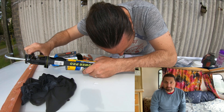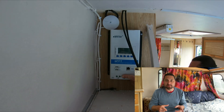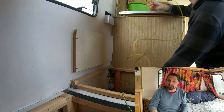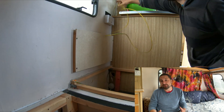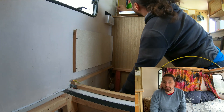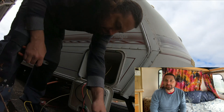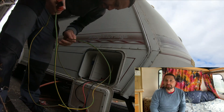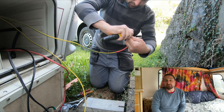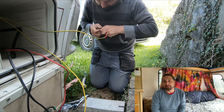After passing the cable down through the roof I fitted the charge controller. It doesn't look straight in this shot but it is — the GoPro camera I film with has a fisheye lens which distorts things. Next I read that I had to power up the charge controller from the battery before attaching the solar panel, so I ran cabling to it. If you have sufficient spare from your solar panel cabling you can use the same cabling; I didn't, so I used 6mm square earth cabling and just marked it up with electrical tape to show the polarity. This was run down from the charge controller along the walls and through the battery box. After running the first length of cable I should have gone back along its length and marked its polarity with tape at a number of different locations, as this only became a problem later when I installed an inline fuse and needed to know which was the positive.